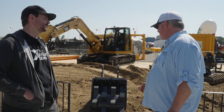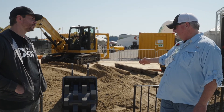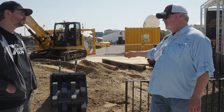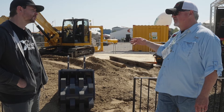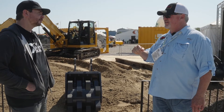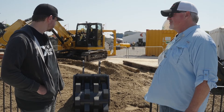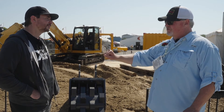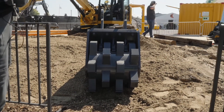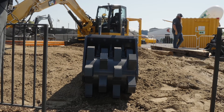That was kind of a neat discovery. Typically there's a leveling blade on the back — that's its true name — but it became apparent with quick couplers that it was nice to get it out of the dirt and off the ground so operators could more easily detach and reattach it to their coupler system. So it's levelly referred to as a kickstand now, but guys do use it to push and pull material into a trench and level out a lift of dirt before they then use the compactor to get their compaction.